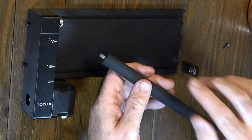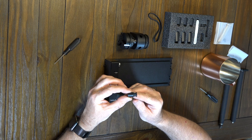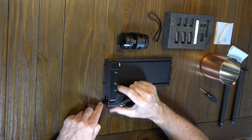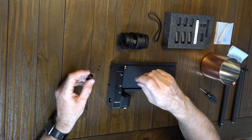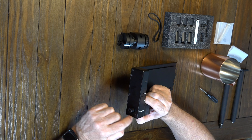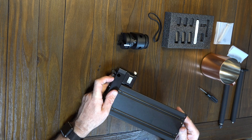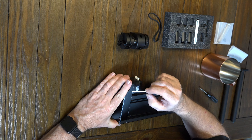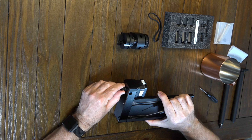Pull this end out just like we did on the first roller and it should slide right out. You can see it's got the flat end where the set screws fit into. The next piece you're going to need is this little piece right here — it connects to the belt externally on your rotary tool and gets connected right in the end here. My suggestion is to completely remove the set screws so you can slide this through the hole, otherwise they'll interfere. Flip it upside down and there's a hole in the bottom to access the set screws. We'll place a screw on, fit it down through the hole, line it up with the flat section, give it a little tighten, and rotate to get to the next hole.